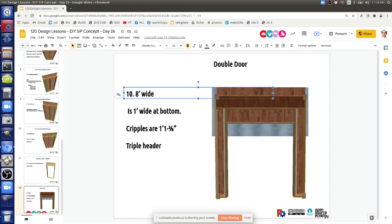But you could, for instance, drill a small hole at one end of the cut and the other end of the cut, to make sure you're not in the stud. And then snap a line. If you're an eighth inch away, that's fine. It will make it easier to get the saw in. Okay, so you know how to do this.